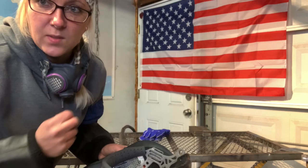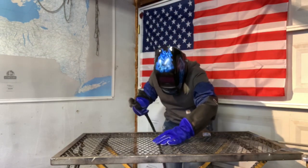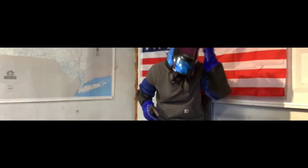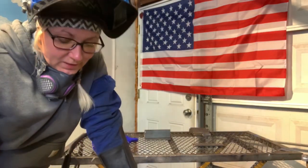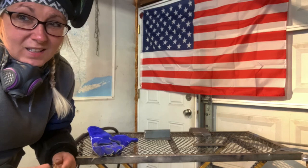I'm going to turn on the welder. I'm going to tack some pieces together so we can do a lap joint and then I'm also going to do a T-joint. Fun fact — the reason that when I first tried to tack that T-joint together it didn't go through is because I didn't clean my material and it has mill scale on the outside of it. I also have paint on my welding table so it didn't ground out properly. So I scraped it so it would go through and ground out a little bit better so that it would tack. I'm going to run a couple beads and that's it — that's how you make a weld. You pull the trigger and I'll have some technique videos next.